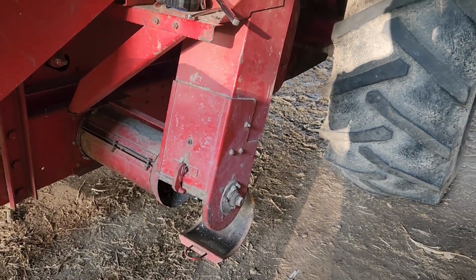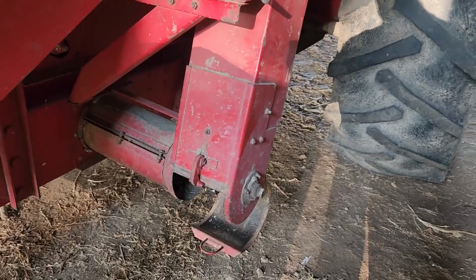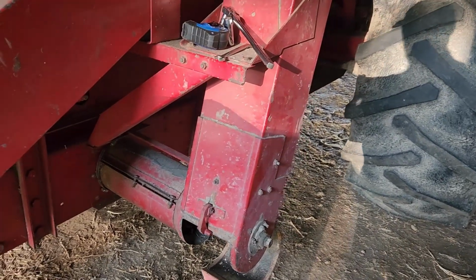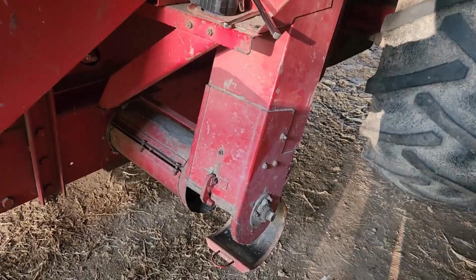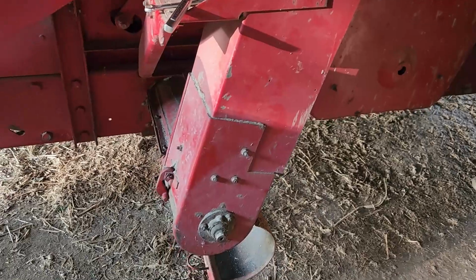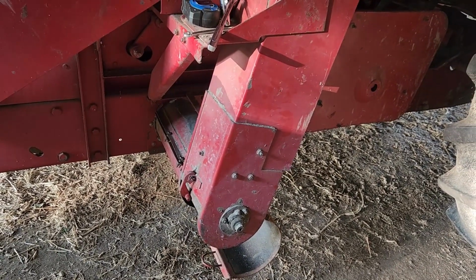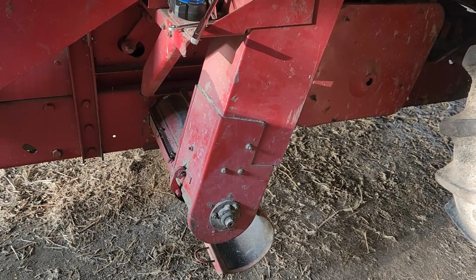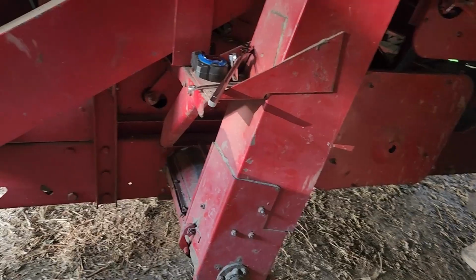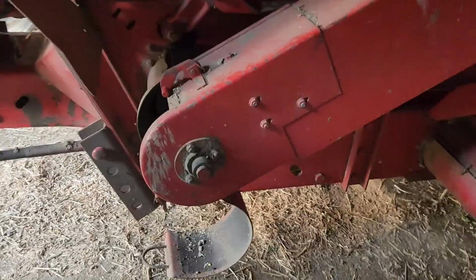I don't know if it's the original chain or not, but in order to have the most accurate readings, got the wrenches all out, just got done servicing the grain elevator here, getting it tensioned up. She's a little loose, and I noticed I have at least one paddle missing, so I'm sure that will get in the way of accurate reading a little bit to some extent. We won't know until we get into the field, and then so we have plans of changing that out. And since I got all the tools out to do that one, we're going to service this one.